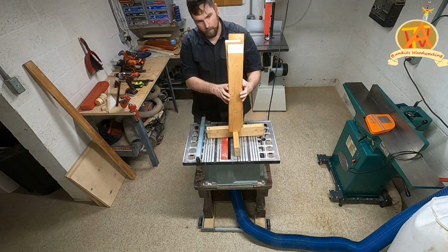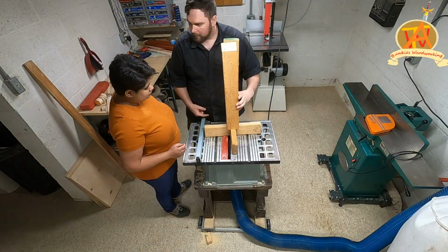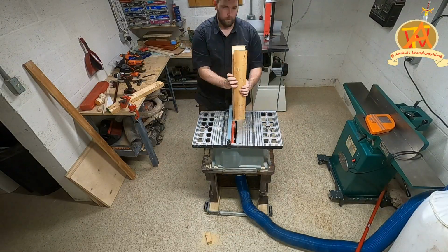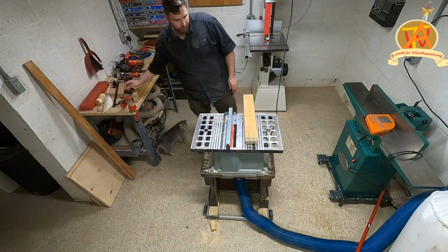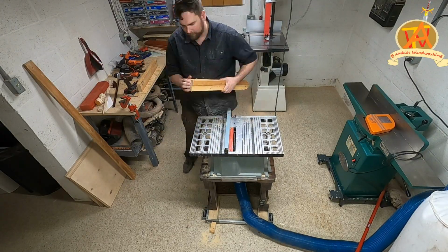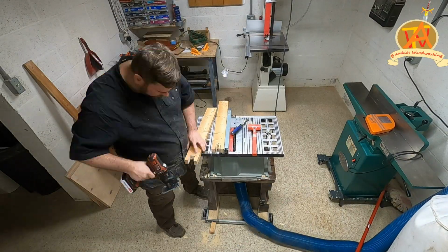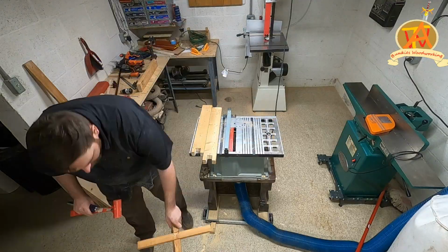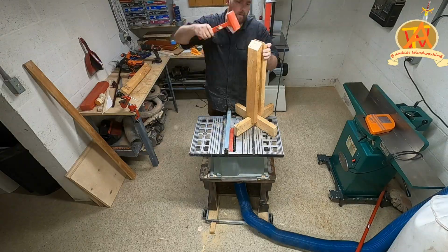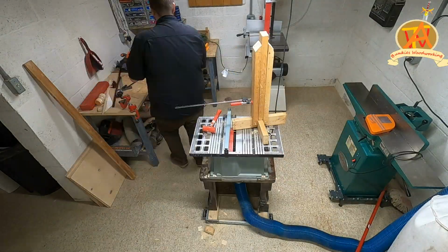We also decided to put half laps on the vertical stand. So we started measuring things out and started to mark where we needed to put half laps on the vertical boards. I carefully started cutting the marked area out of the board so that the half laps would intersect with the stand. I attempted to clean up the area with the chisel, but soon decided to use the jigsaw in order to clean up the area nice and flush. Once again, we did a quick dry fit before screwing the boards in. Then we held the boards in position, clamped them down, pre-drilled the holes and screwed them tight.